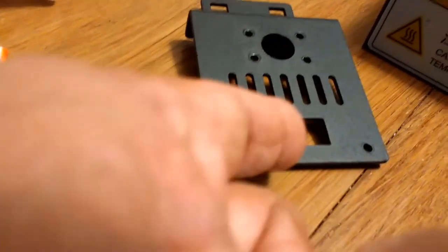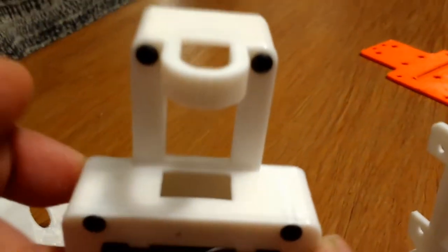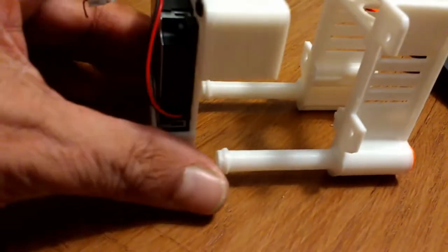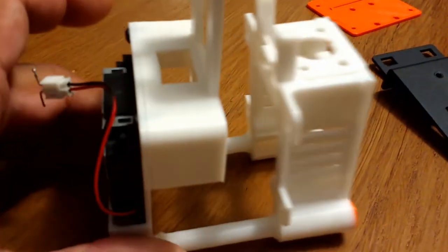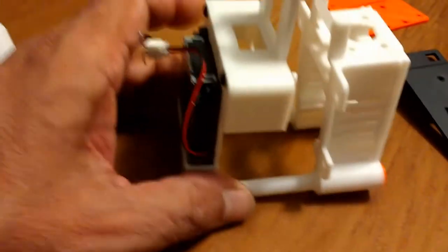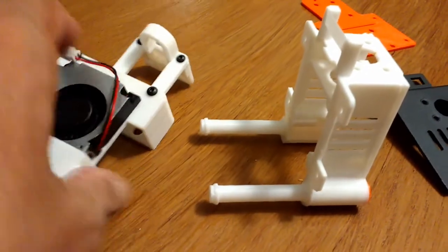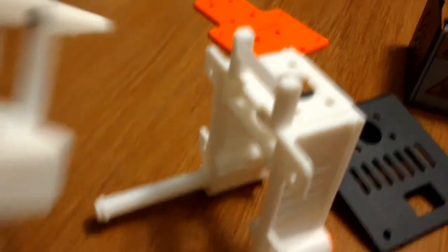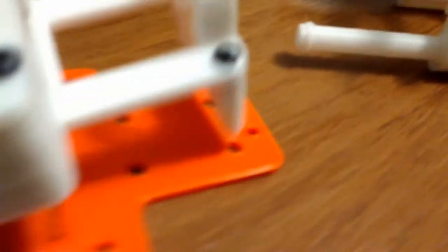There's no need for an offset at the back because the cable is already out of the way, so I went with a more symmetrical and centered connector support block, and the cable just runs directly on top of it. When this is fully assembled, I left this open because it has to go on the machine — although these parts can be installed in a saddle-mount way from underneath the gantry, you can just slip this from underneath. I decided to leave it open until that point. They go in with CA glue, and this part right here attaches to the original bracket — which is black and metal — and attaches to that point right there.